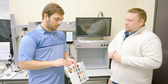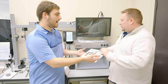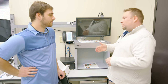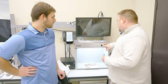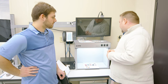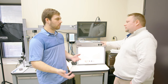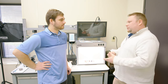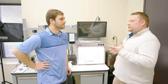Sometimes we have painted fasteners, and it's important to know that the color of the fasteners is matched to the roof panels you're going to be installing. To ensure colors are matched, we use a light box. Typically I'll get samples from each shipment so we get a consistent look over and over again and have confidence that we're going to match up. A light box like this has three sources of light; we really concern ourselves with daylight because our fasteners are going to be outdoors. We match a sample to the screw we get. It's a little bit of a judgment call, but the light box is supposed to take out variability — otherwise under fluorescent lights, or outside on a cloudy or sunny day, there's going to be variation on what the color looks like.